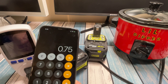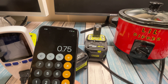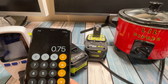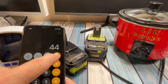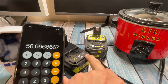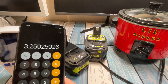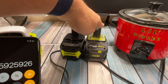If you use this inverter and just use the DC USB ports on it, you're going to charge up a lot of cell phones no problem. But if you want to cook some chili or queso, you're only going to get about 20 minutes out of one of these batteries. So applying that 75% efficiency: if we take the 44 watt hours we measured and divide by 75% efficiency, we find that the battery likely has about 58 to 59 watt hours of actual DC capacity. If we then take that 58.67 watt hours and divide by 18 volts, we get three and a quarter — basically 3.25 amp hours — which is about what I guessed based on the size and weight comparison.